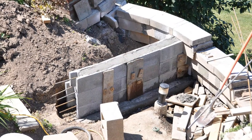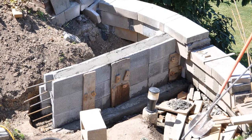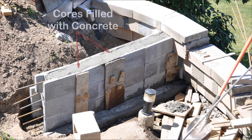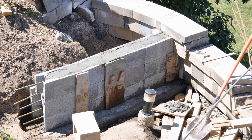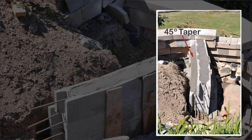The block is filled with concrete. In this side view of the wall, the Ivany block clearly forms the form for the reinforced concrete core. It also takes much less concrete to fill the block because the blocks act as the wall. Note how the concrete tapers at roughly a 45-degree angle from the 12-inch block to the 8-inch block.